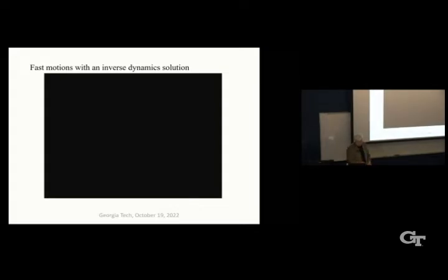we have used in the past a full 3D inverse dynamics model. The model we use now and have for a long time is a separate controller running in the sagittal plane and the coronal plane. So two controllers, one that's doing this and one that's doing that. And it's not perfect, but it works great and it's really simple.